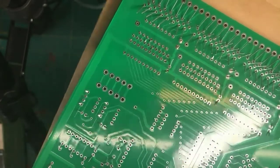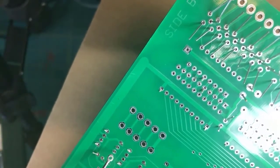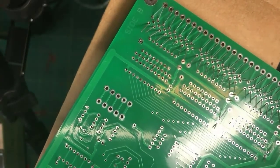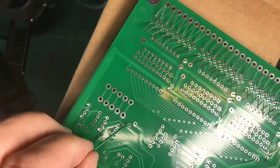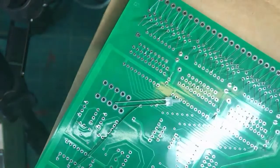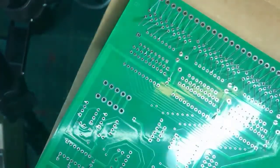Now, you can, of course, hold your finger on the other side to hold it still while you solder, except that you need one hand for the soldering iron and one hand for the solder. So bending leads over, or as I saw in this example, making the lead capture whatever you want to solder it to. In this instance, I'm going to solder this lead to this light emitting diode. But having that curled wrap around like that is going to make it much more successful to have a good joint, because I'm not sitting there doing this, and we've all done it.